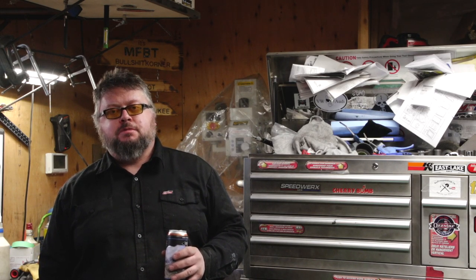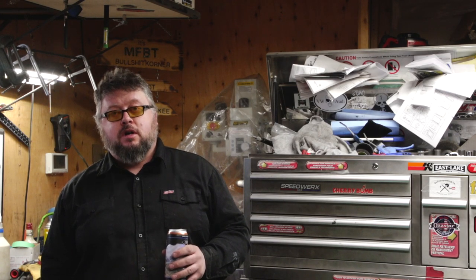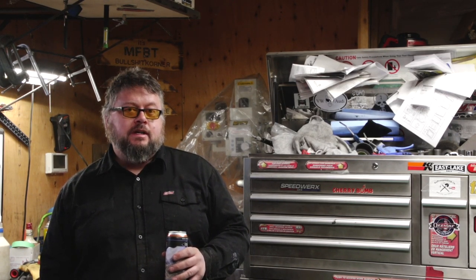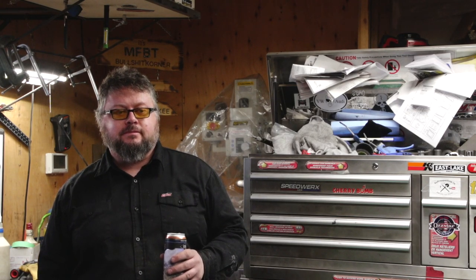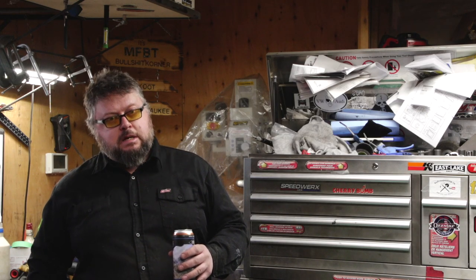There you have it. I gave you the directions and measurements that I used to build your own log cutting jig. Now you guys can build your own. As always, be careful when you're out there because there's been situations where we've been cutting some wood, once you get towards the end, there's not much weight on it. So when you're cutting the wood, the logs sometimes can fly out towards the end. Could be fatal if you're not paying attention.